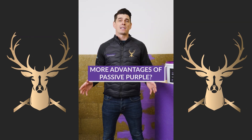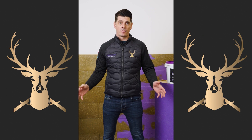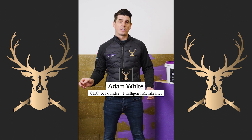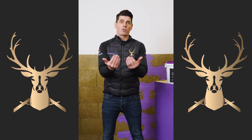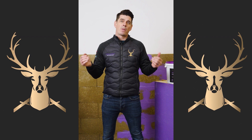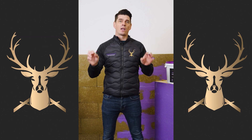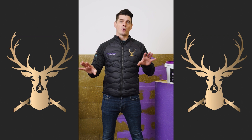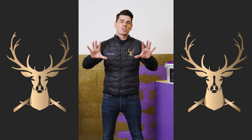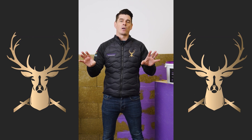More advantages that Passive Purple has on masonry or timber frame construction: unlike traditional tapes and membranes where you're covering a large area hoping it's all airtight, Passive Purple fixes all the air loss areas at their location. We're fixing a seamless seal over the whole building and we know all the airtightness is achieved in one go.